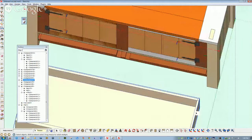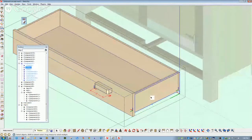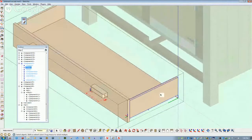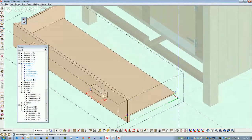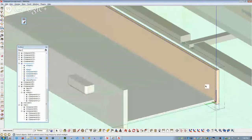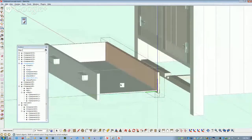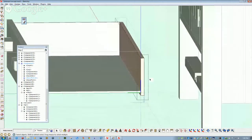Now, do I have issues on this corner? And something else you can see that I didn't do, I have not fixed these corners here. They are butt joints. And I'm trying to find out, I don't even think I have that one. Right. This one is not the right one. So see, now that I look at this, I really should have spent another 20 minutes putting the dados in, or at least rabbets on here to make this drawer right. It wouldn't even have been 20 minutes.